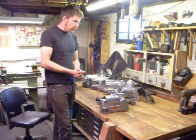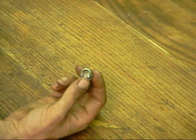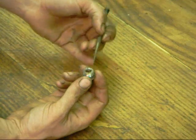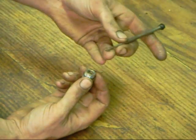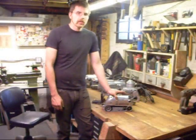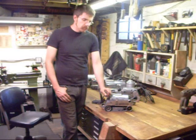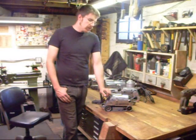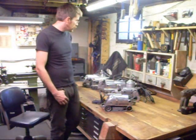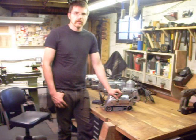The other thing to watch for is to take out the oil plug here and inspect it. You may find a bronze-colored paste, which is indicative of severe gear wear — the sander will more than likely need a gear replaced. On the 504, the part is still available at about $35. But on some sanders like the T-33, the gear is no longer available, having been discontinued for 50 years, so a damaged gear will lead to a certain amount of improvising.